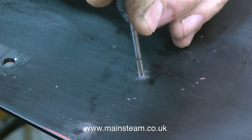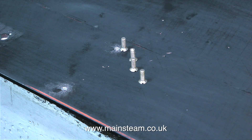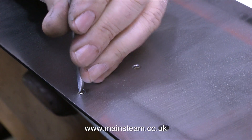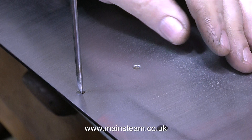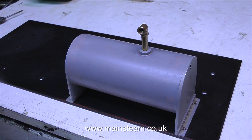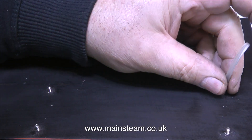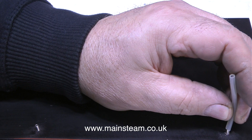Using a 6BA tap to thread the four holes in the bed plate. All I need now are some 6BA countersink bolts, and here they are. When I did this job on the boiler's bed plate to support the pump, I used some Loctite 603 to make these bolts captive so they wouldn't come out of the holes easily. I did that because the pump is a mechanical component that could need replacement, but the condenser isn't a mechanical component as such, so won't need replacement. In this clip, I'm using some pieces of silicone rubber tubing to push over the threads, because I don't want to paint them.